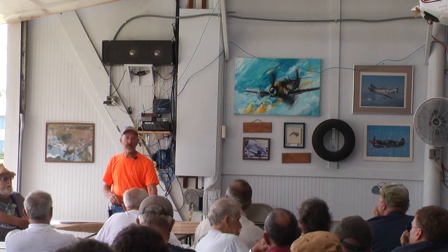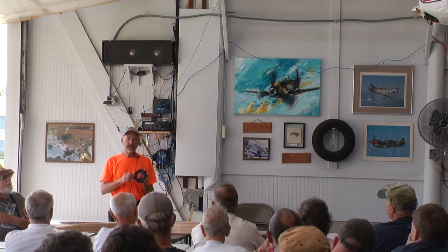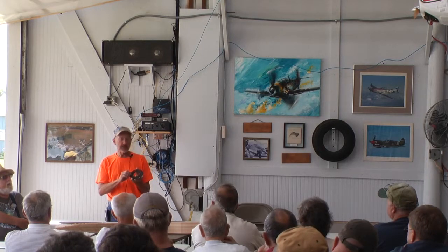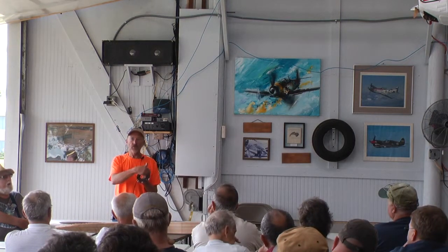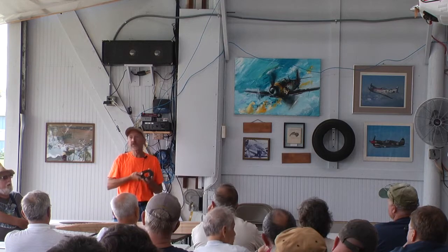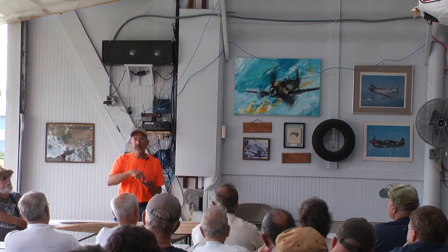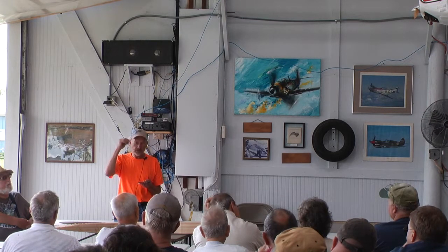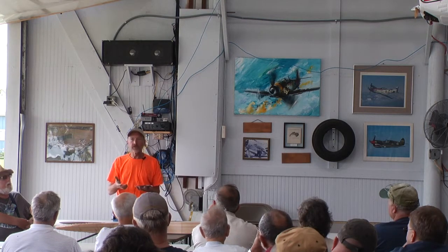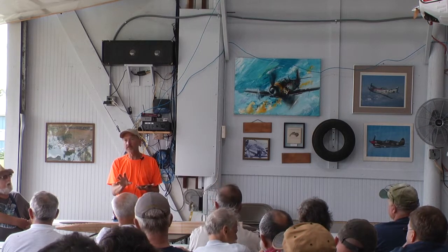The gentleman said that the way Oldie Phelan did it was, the first hole was drilled clear through the propeller. And he probably even bolted it on at that point, so it didn't move. Then he proceeded to drill halfway through one side, took a crush plate, transferred it to the back, flipped the whole assembly over and drilled the second half of it. And I guess the theory was that he completed the hole from the second side. The theory being that it's going to be more accurate and line up with the propeller hub, so you're not going to be off when you bolt it on.